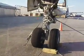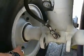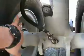What's really unique — we're going to walk up front to the front of the airplane — and most people are under the misunderstanding that commercial aircraft have brakes up in the nose, and that's not true. We'll show you what the nose gear looks like, and you'll see that the nose gear on this aircraft, as all aircraft, does not have a braking system up in the nose. Therefore, there's no pins, no brake pads. It's just the rim of the tire with the axle, and this space — as you saw back there — will be reserved for the brake pad itself. That gives you a general idea of what the brakes look like.